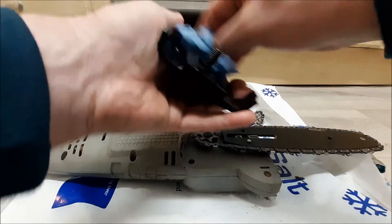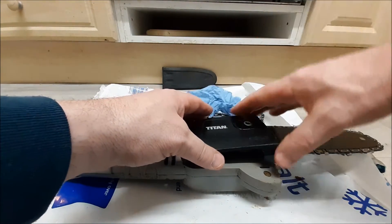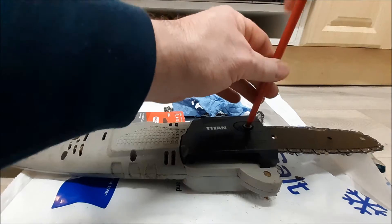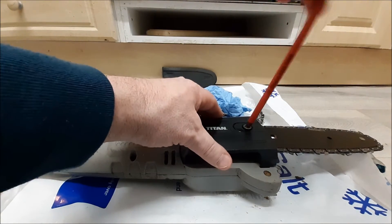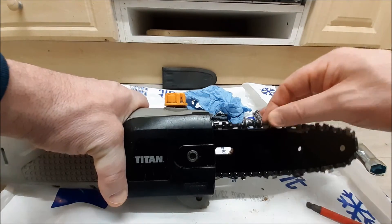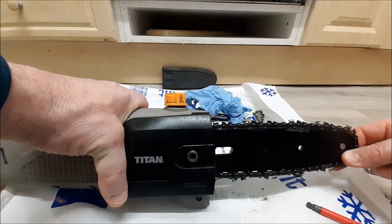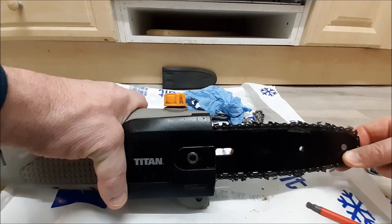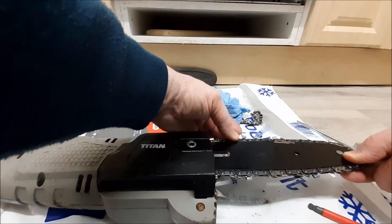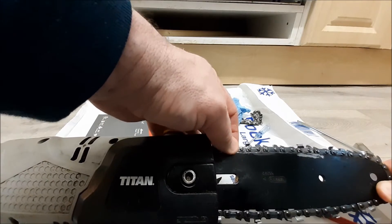Give the cover a quick wipe — not that it's too bad. The professionals always say when tightening the chain, hold the bar up — because when you're pushing on it while cutting it's being pushed up — so holding it up keeps it at the right tension while you adjust. You can see that chain's got a little bit too much play in it at the moment; that would be too loose.